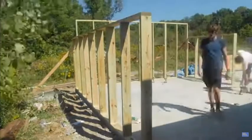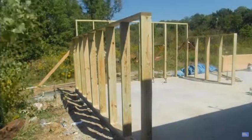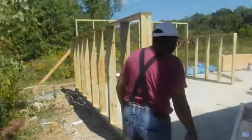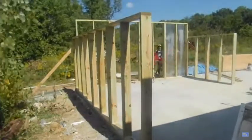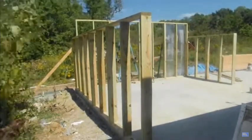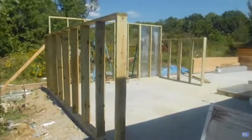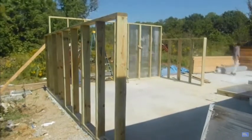We can put together the modules and they pretty much remain even. All we had to do was put little shims underneath them to keep them straight, and then put on the top plate — you do want the top plate on, otherwise the structure has much less stability. We are connecting through each module, so about five screws per module. Holding capacity of one screw is about 300 pounds. On the corners — the corners are most sensitive — you want to button those up. The proper schedule would be every eight inches or so for corners, if you want something that withstands really high winds.